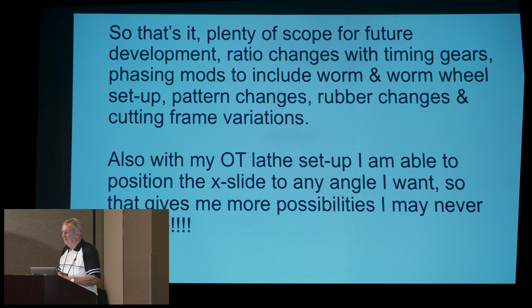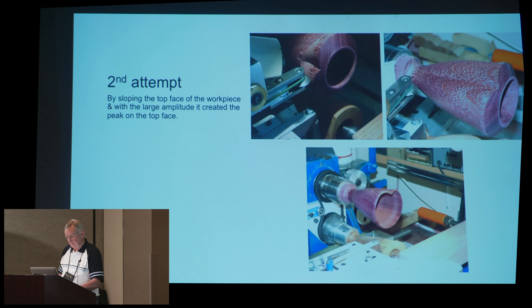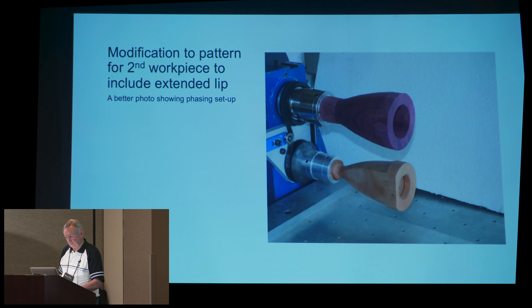Are you introducing a further curvilinear or pattern to the shape lineally? Well, that's on the shape of the... So that shows the template at the bottom. The bottom piece is your pattern. That's why I call it a rotary curvilinear — because normally that's where you put your template for your curvilinear, and your rubber would go up against that. But in this situation, because it's rotating, I decided to call it a rotary curvilinear, just for the sake of it.